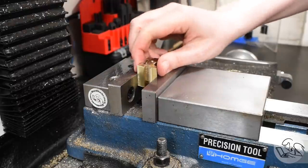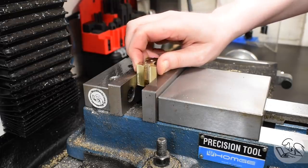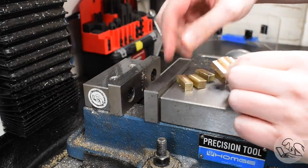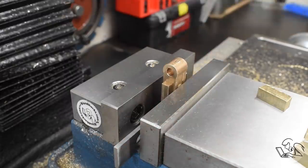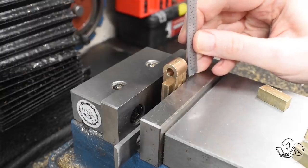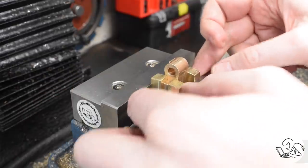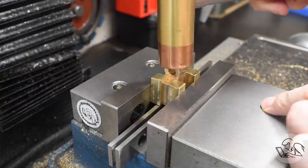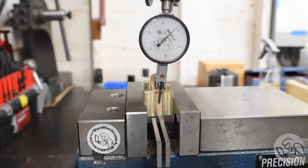That stack of packing blocks was a little fiddly but it did the job very well. I'm going to reuse the setup on the other end now so I can cut the slot that makes this boss into a clevis. In principle, since that bottom has been machined square I can just set it on a parallel, but I'll double-check it. I need to make sure I've got enough height for cutting the slot without hitting the vise jaws, then I'll get those packing blocks back in there and tap it down nice and square. Sure enough, we're about two thou off, so I tap that straight and check it one more time - and that's looking good.